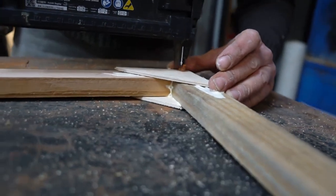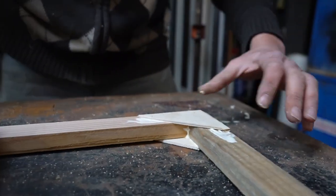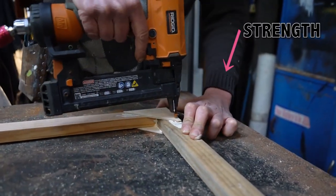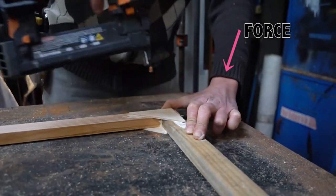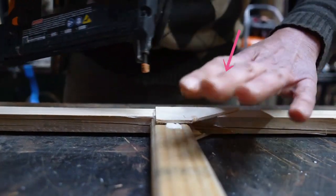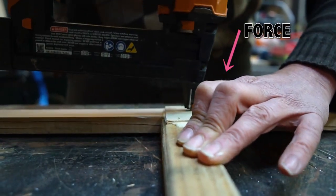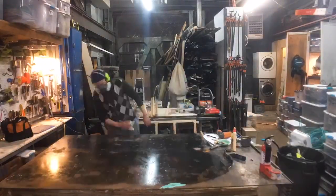As before, staple the joint in the lower horizontal piece, then force the two pieces together before locking it tightly together with a staple on the vertical piece. You don't need as many staples on this side as the original, and you don't need to use your square with this side. You can't change anything at this point. The frame is complete, and you are going to move on to the door.